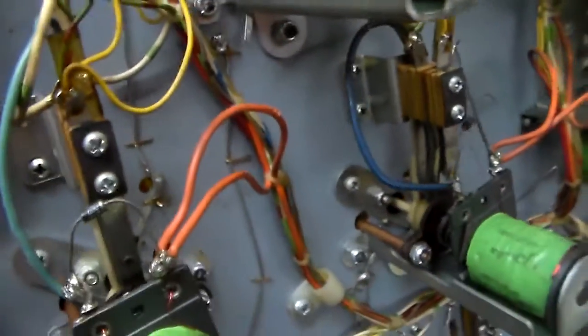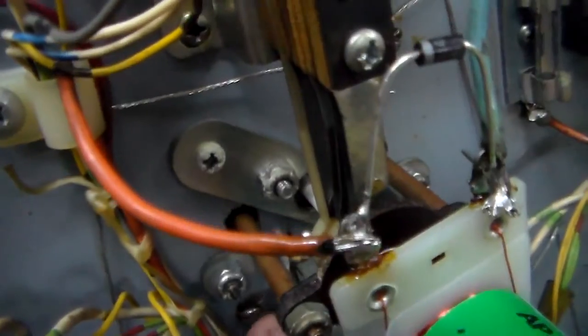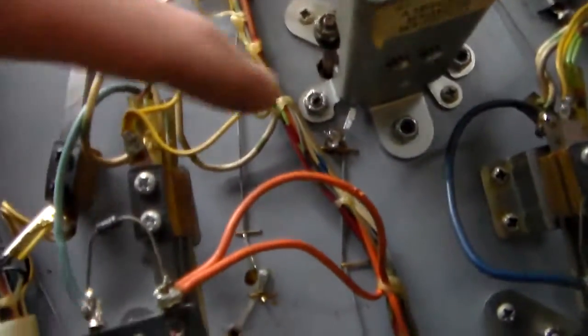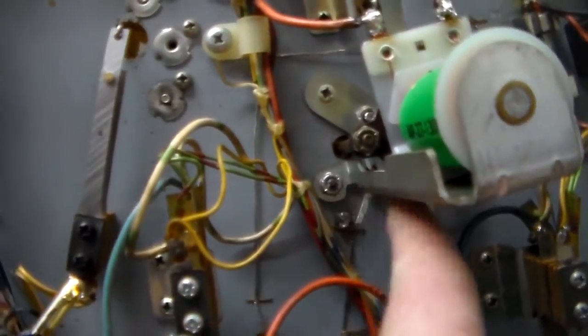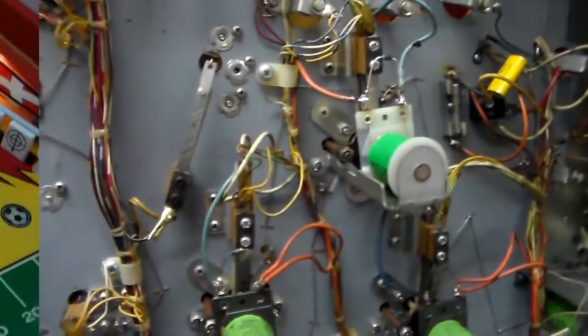You can see I've got my little wires sticking through the playfield — that's for the light. I've got to solder that back in there. The tricky one is this wire that comes up and you have to kind of move it under that bracket. We bent it a little bit so now we can lay it down on the wire and solder it back together. The way I usually do that is I heat it up with a soldering iron and then use a little screwdriver to hold it in place while the solder dries.